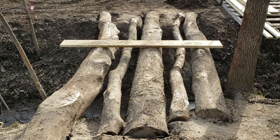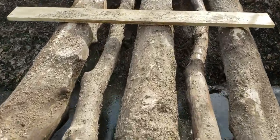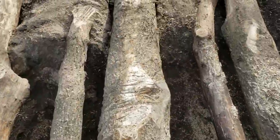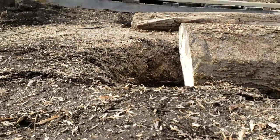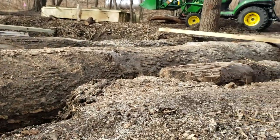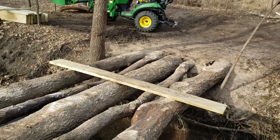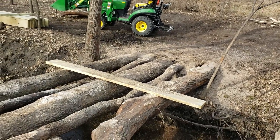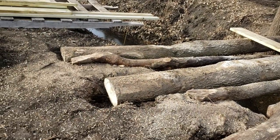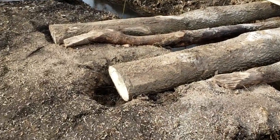In order to share the load on the other sides, I have to pick up this main center beam and lift it up on this end, because compared to the ground bubble it's still sitting up pretty high. Once I raise that one up I can get the surface system made up better. Down in this spot there will still be a natural low spot even with the beam lowered a little bit, so my next move is to take it down yet a little bit more.